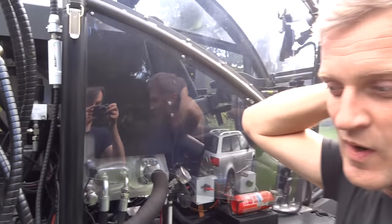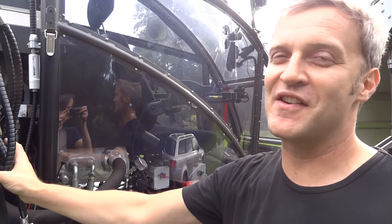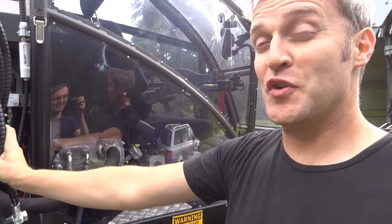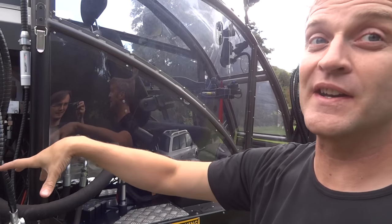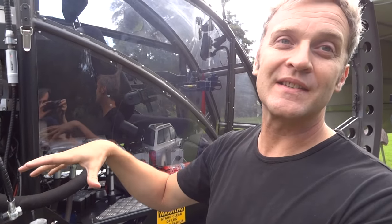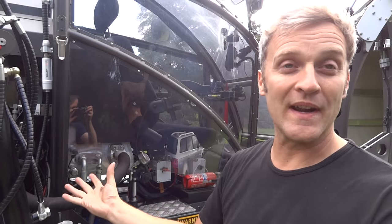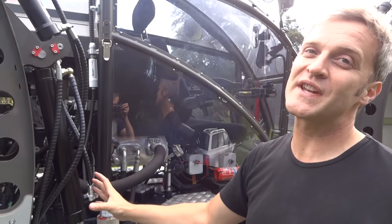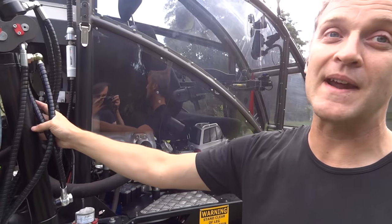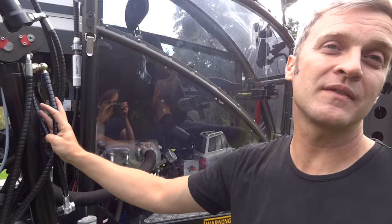So what have we got here? Some new hydraulic rams. So what was the reason for replacing those? Basically there was a fundamental engineering error — the assumption was that when the machine was stood in a tripod (one middle leg on one side and a front and rear leg on the other side), the weight would be shared equally amongst those three legs. That's not the case. The middle legs always take more weight — in fact nearly half the weight of the machine. So we built them all with the same equal power on the middle leg rams. I've now upgraded these middle legs so they can support more than half the weight of the machine.